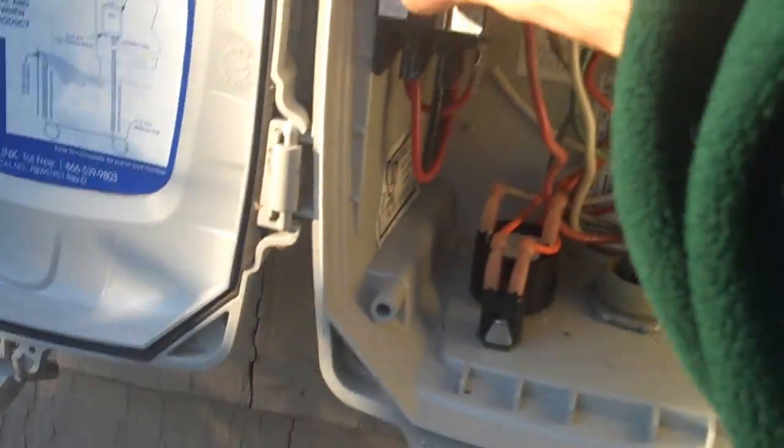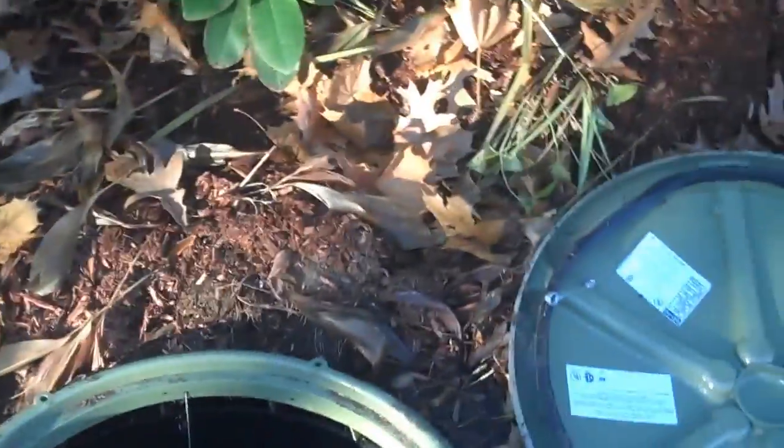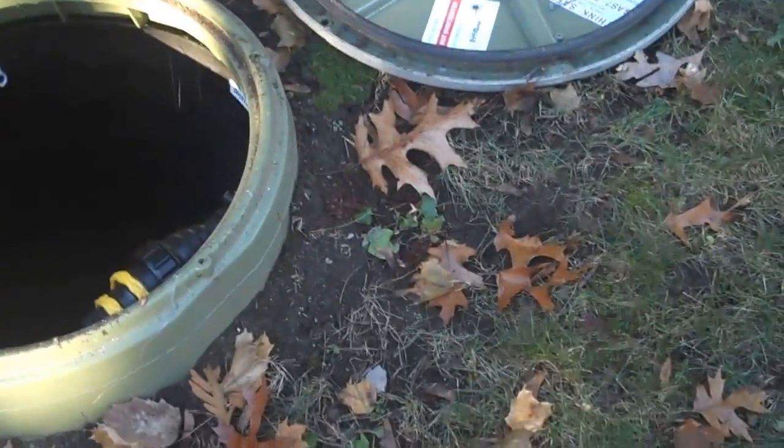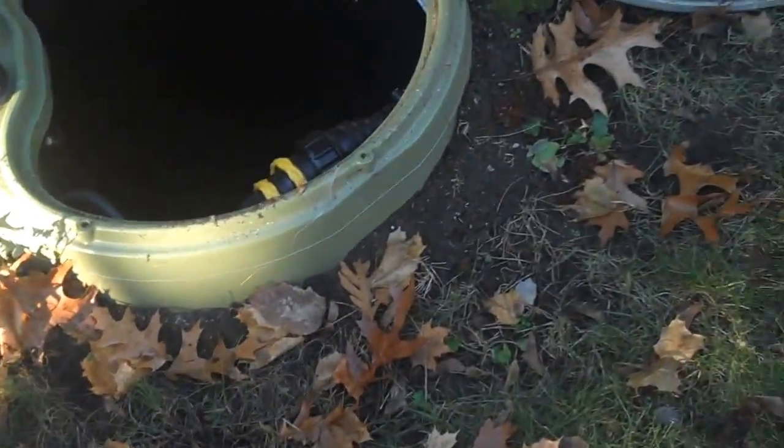The alarm has gone off, so I'm going to go over and turn Jan's pump back on. Now the pump is going to start running, but it could take several minutes to pump out because we just put in 25 gallons. The pump will pump about 8 to 10 gallons a minute, so it could take one or two minutes to pump out the water below the alarm level. I'll silence the alarm just like we did in the other video. The alarm is silenced but the red light is still on.